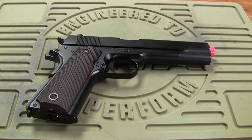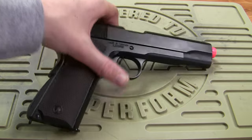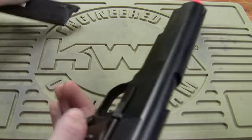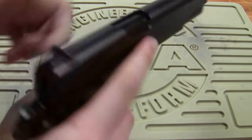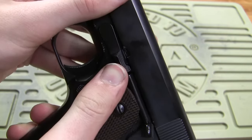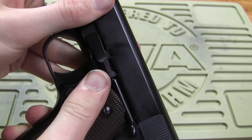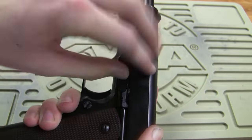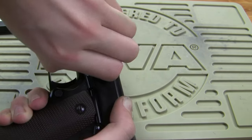This is going to be a video on how to disassemble and clean a KJW Works GBB-609CO, or the 1911. Step one: take the magazine out of your pistol. You're going to pull the slide back until the slide lock is close to the takedown groove, then push the pin over by the trigger out at the same time.